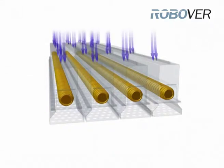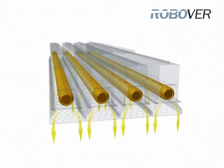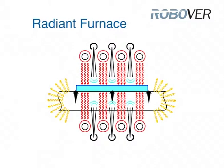The air flows through the heating elements and is reheated before being blown through the nozzles onto the glass surface. This arrangement is both from the top and bottom side. This is far more efficient than radiation furnaces with convection through compressed air can achieve, which have open electric heaters and air aspirators in the furnace only.